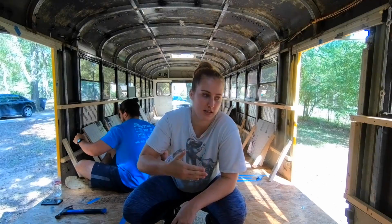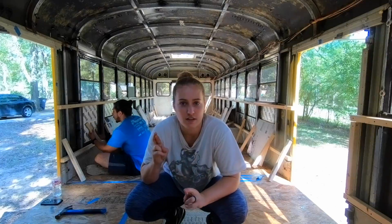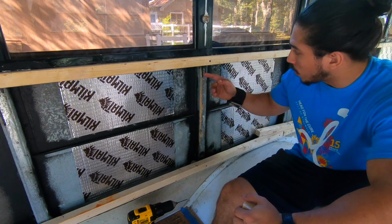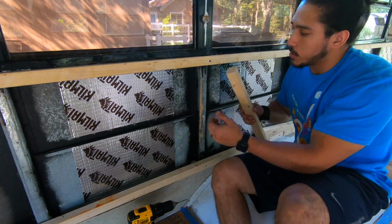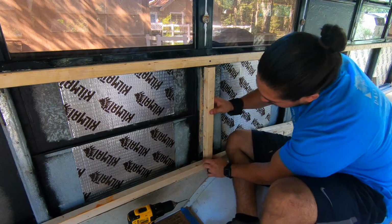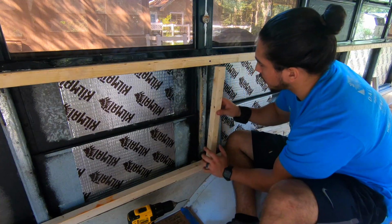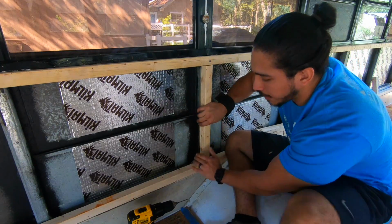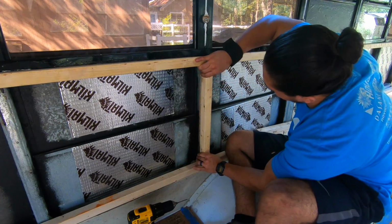System to knock out these pieces of wood that are going up and down, and we're gonna hope that our bits last us through the rest of today. So there are some that, because we ground the screws out, still have a piece of screw sticking out through here. So we are measuring exactly where it landed, making sure that the hole that we pre-drilled is below that or above that. And then this one in particular has 1, 2, and 3 spots. So I'm just gonna go ahead and put it as far away as I can from those, and then I'll get a hammer so we can go ahead and make an indentation on those pieces.